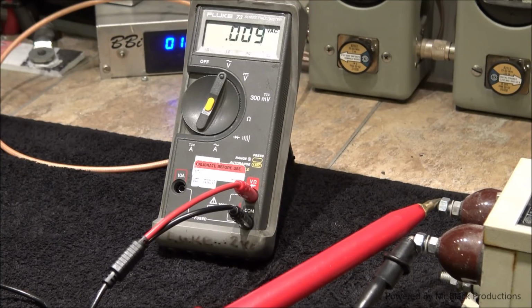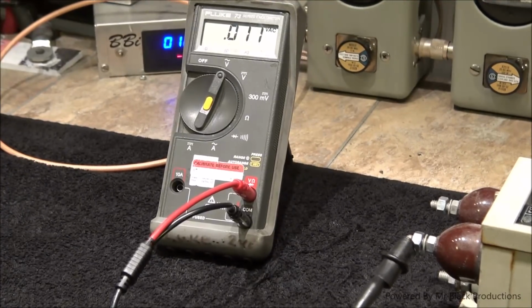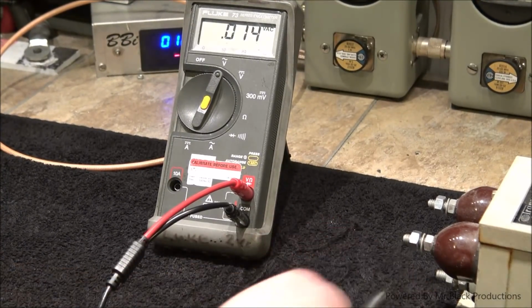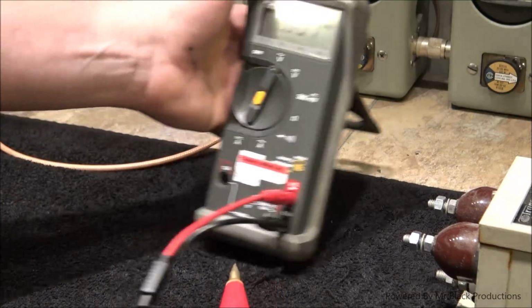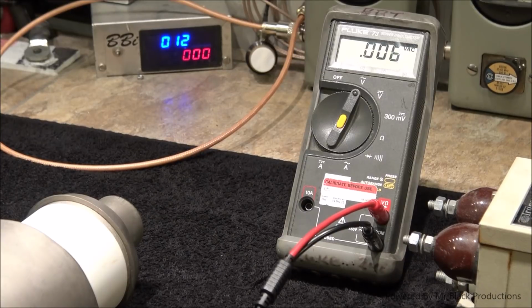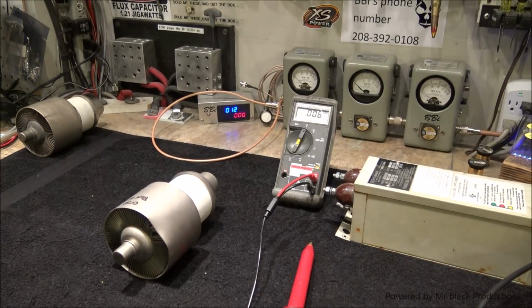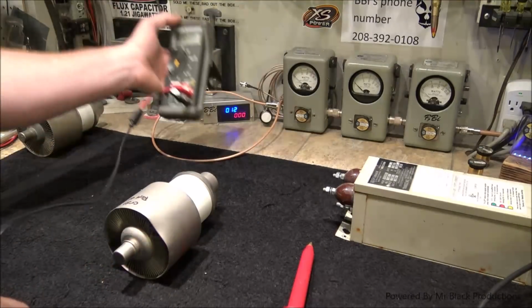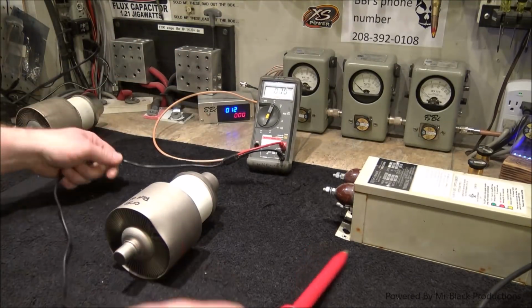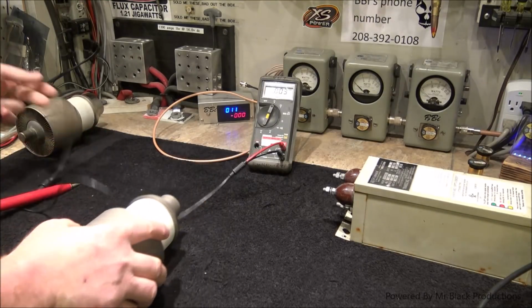So we'll go ahead and we're going to shut this down. So now our circuit's neutralized. Let's go ahead and shut that off and physically unplug it. Our circuit is neutralized. And so now we're going to put that same amount of volts on the anode of this tube. And we're going to see what our breakdown, love that term, our breakdown voltage is going to be. Okay.